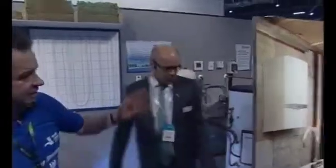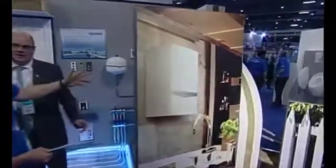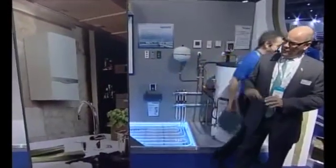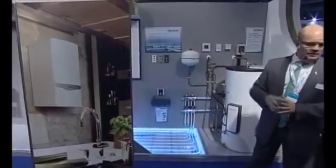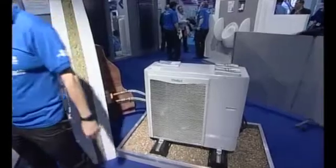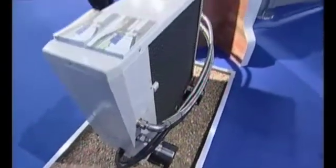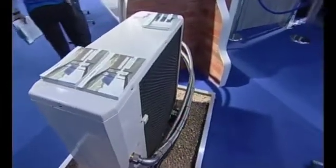So it's just a simple case of taking the boiler off the wall and putting up a pump, isn't it? Not quite. The boiler being removed is currently about 90% efficient. With heat pumps — which are behind my garden bush — these units can come in at about 300–400% efficient. But it does depend on atmospheric temperature: how cold it is outside, and therefore what the unit can actually produce. What's different compared to a boiler install?